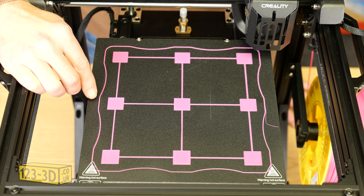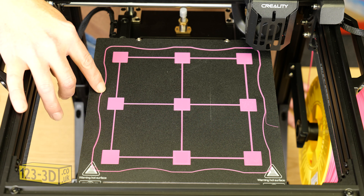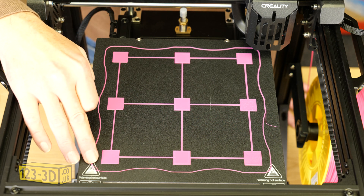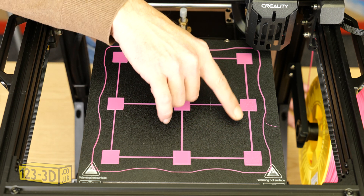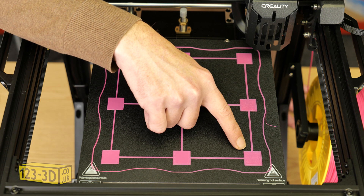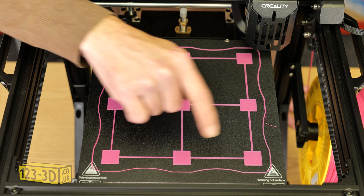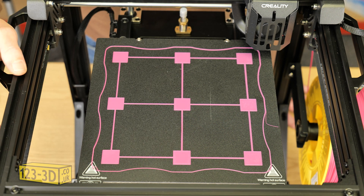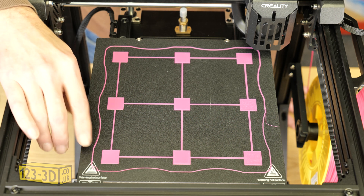So we've finished with the calibration print. As you can see, down this side, as we were adjusting the Z offset, we weren't quite getting enough squish. But the rest of it, all the way around, after we made that adjustment, we can see that we've got nice print lines. To this side of the bed we could be a fraction low — like 0.1 of a millimeter. On those three squares we have a little bit of a rough surface, whereas these are nice and smooth, everything's squished down. So we can say that this print would be a successful print — we've got no problems with bed adhesion.